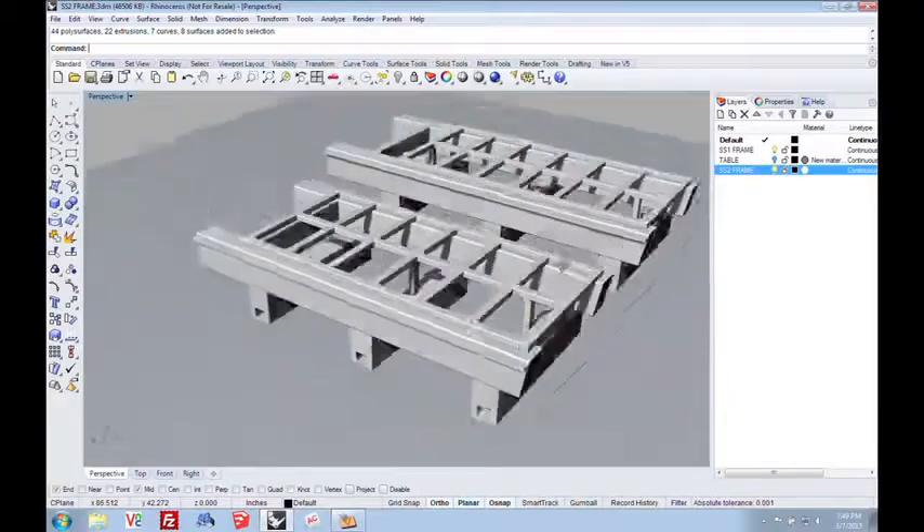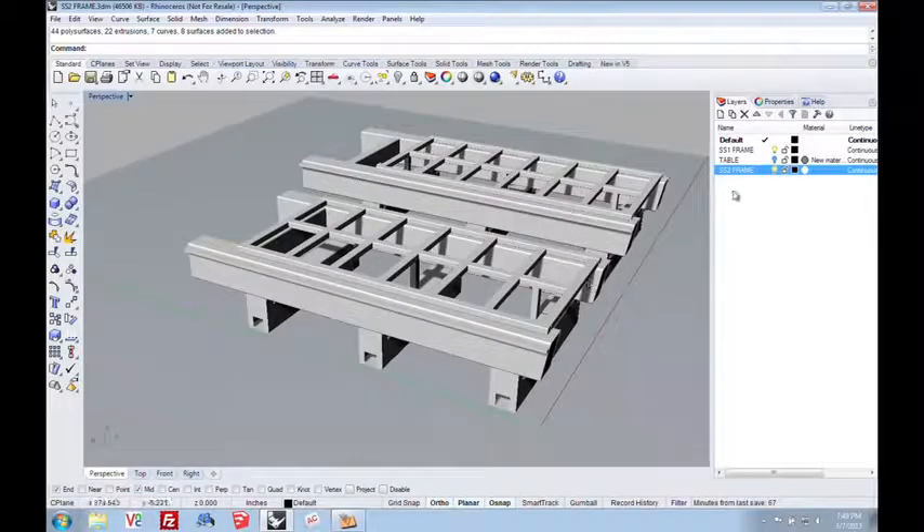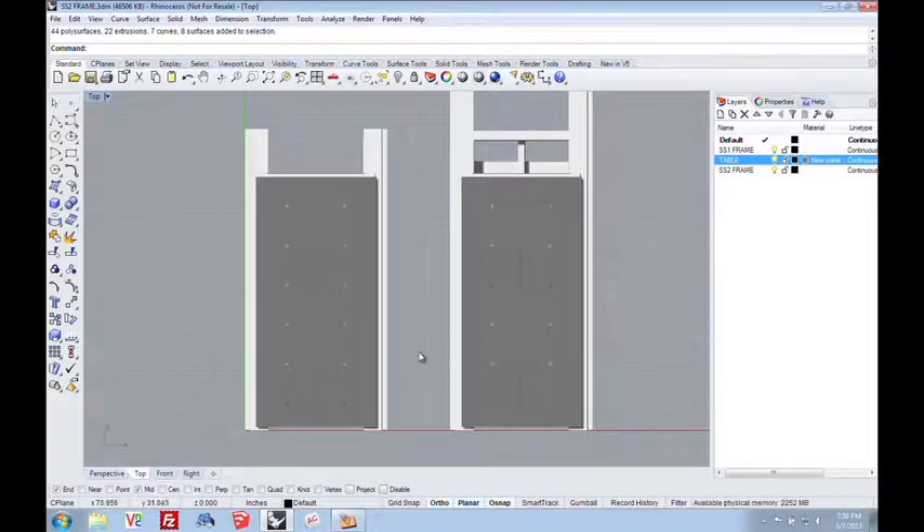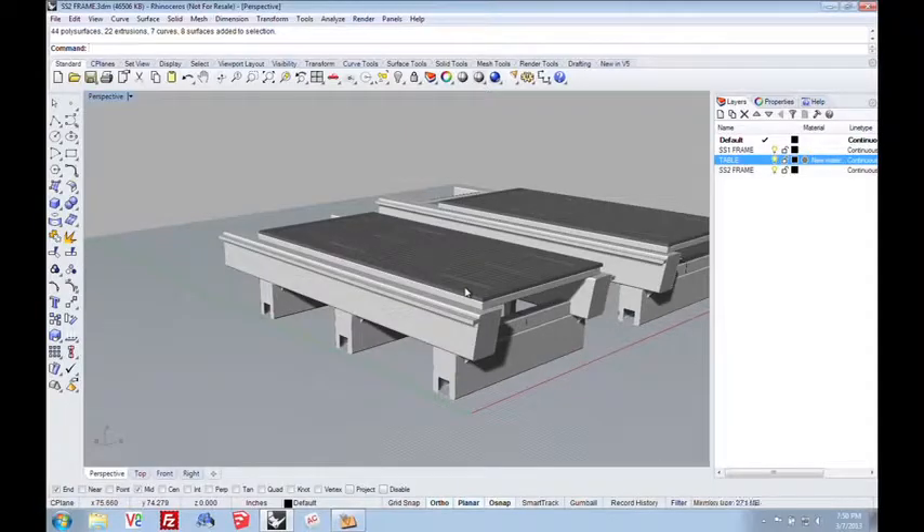That's how the frames are constructed. Now let's turn the table tops on, and if you look from the top view, the table top designs are identical. It's our universal table designed for flow-through, it has the T-slot feature, all of those things. The machines basically use the same mechanical engineering concepts in their frame designs.